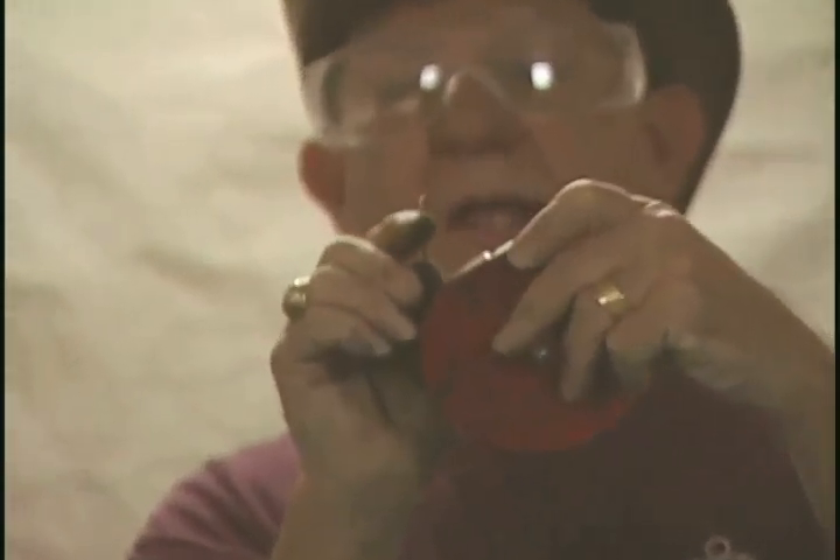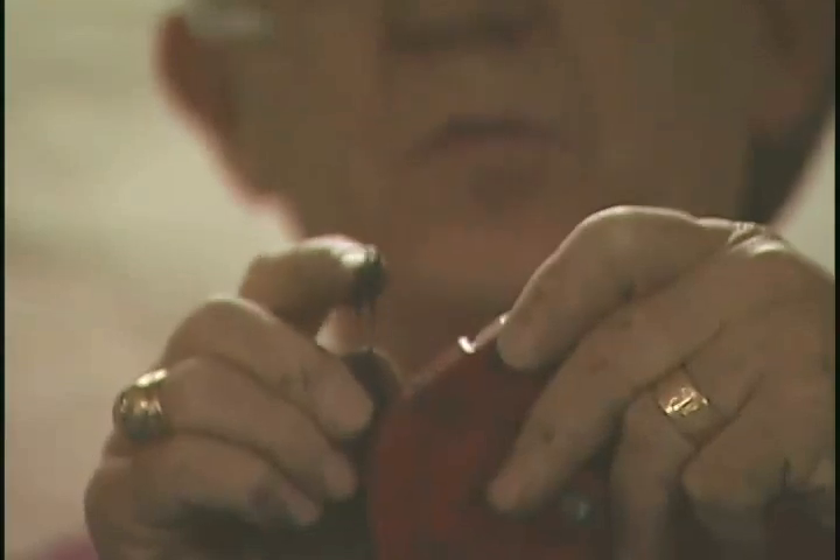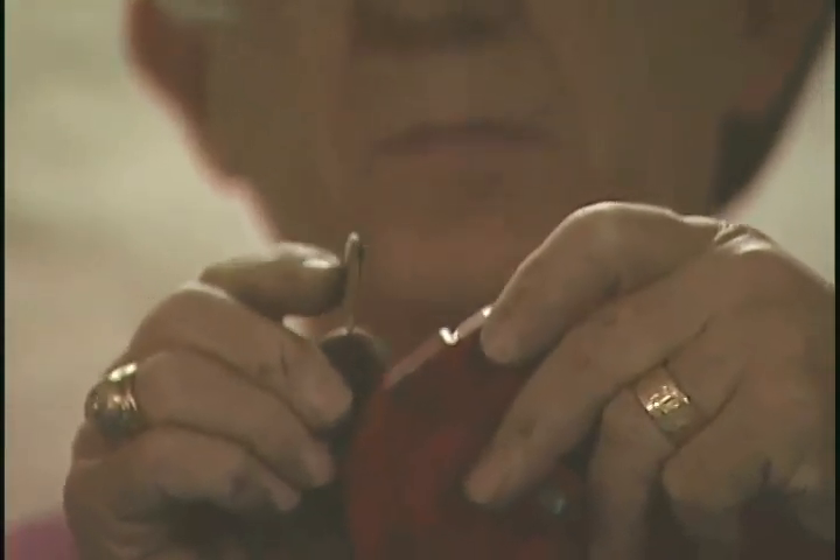As you see, there's a bent end in it. If it breaks at this particular point, then you have an issue with it being able to be bent. Spring steel does not like to make sharp corners. I'm sure that particular feature was put into the end of the spring before it was finely tempered or if it was perhaps reworked metallurgically.